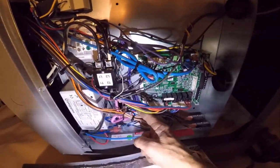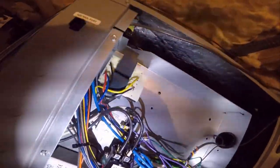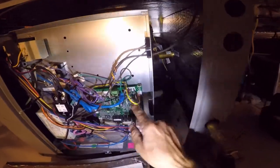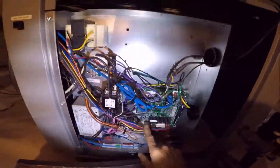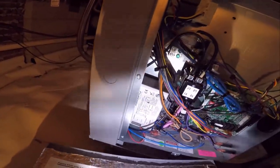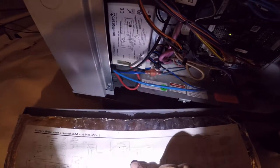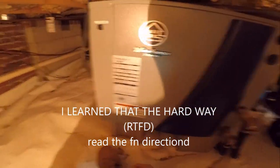Plug your transformer in — that's the black, blue, and red wires. The red is 208, the blue is 240. The transformer also has a little fuse popper on it so you're not worried about tripping breakers. There's a fuse on the board too. The Intellistart reduces starting torque significantly. Note 2 here: the black, white, and gray wires are removed when auxiliary heat is installed. Failure to do so will trip your breakers, because you'll be wiring your 240 from the transformer side and 240 from the heat strip side together — done that before.